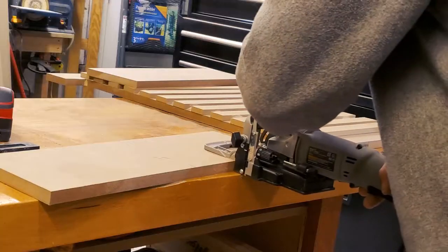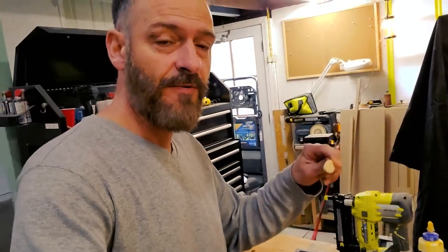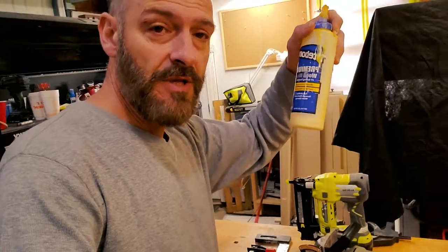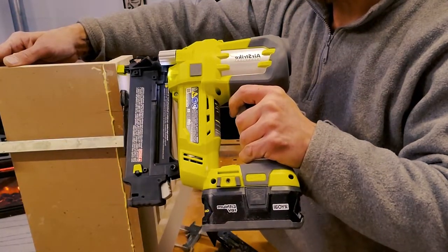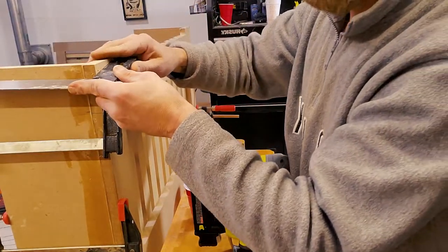For assembly I'm using a combination of things to help the glue dry: a biscuit joiner with number 20 biscuits — solely for alignment — some F-style clamps, premium type-two glue, and inch-and-five-eighths brad nails to prevent shifting while the glue dries. Use a good square to make sure your sides are perfectly perpendicular to the base frame. One consideration: a lot of people use radiator covers as extra seating or shelving, so you want to over-build them a little bit — not too far, but you don't want something flimsy that will buckle if somebody sits on it.